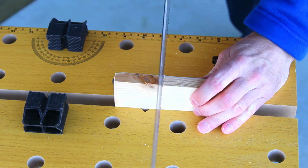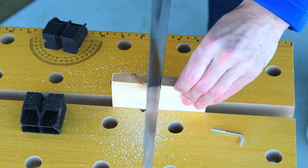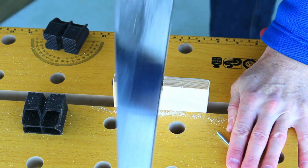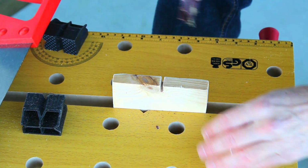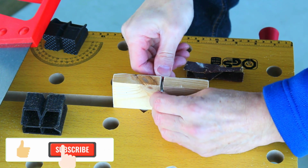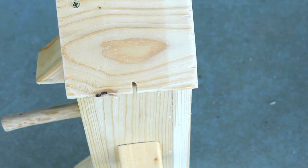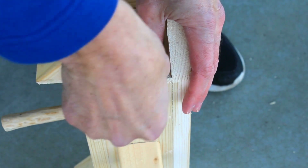For this to work, I'll need to cut a slender groove in the edge, so I'll do this using the saw. To thicken the groove, I'll carefully angle the saw to shave down the sides. I'll sand down the groove to get a smooth, snug fit. Next, I'll close the lid and drill a hole in line with the groove. The L-hook screw can now be twisted in.